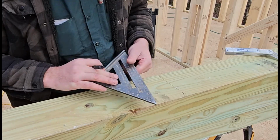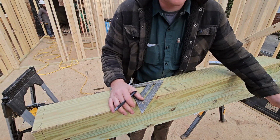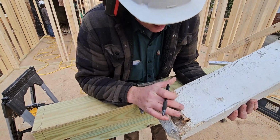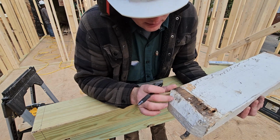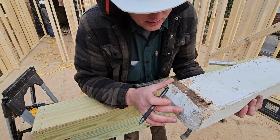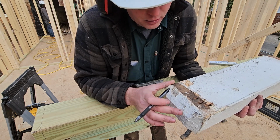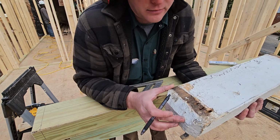So chances are it was beveled at a 45, and just with all that paint you lost a degree or two, because you can see where it is majorly caked right here in spots. Here's pretty clean, but then there's not enough of an angle here, and then you got a big glob of paint right there, a big glob of paint here. Here it's smoother up here, but then there's a big glob at the front, which is going to bring that angle up some. This is roughly where I measured it, and that glob right there probably turned a 45 into a 42.5.